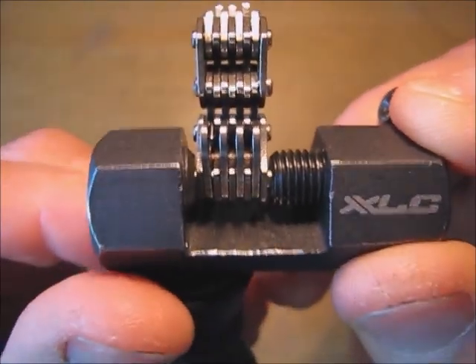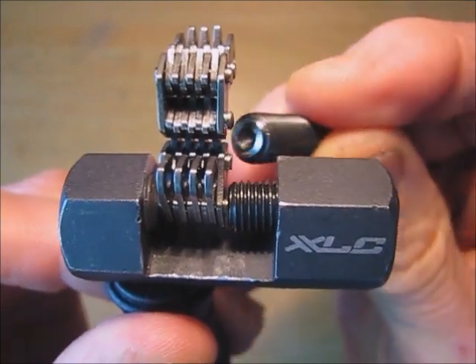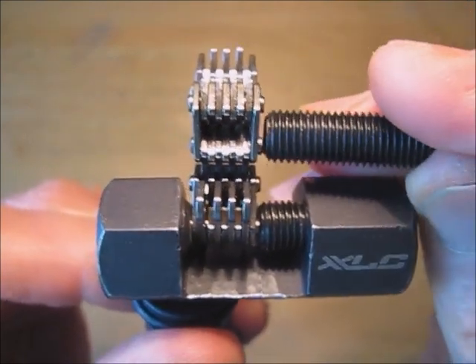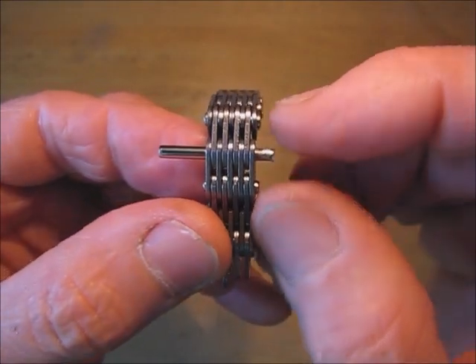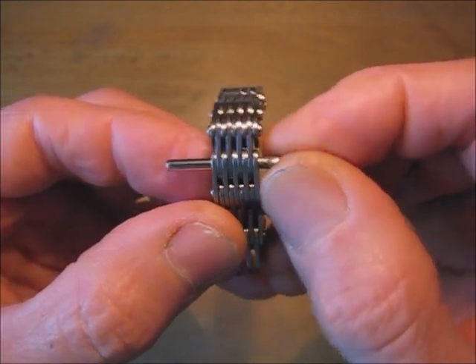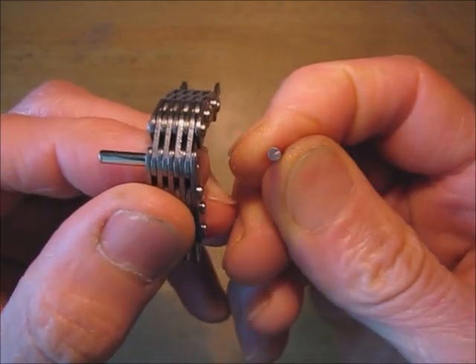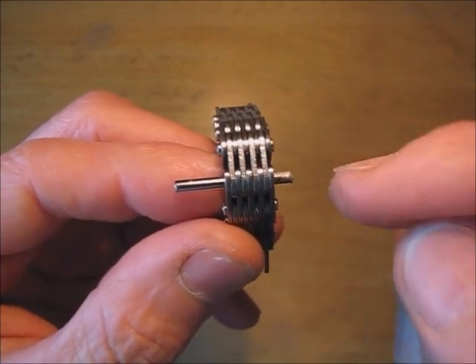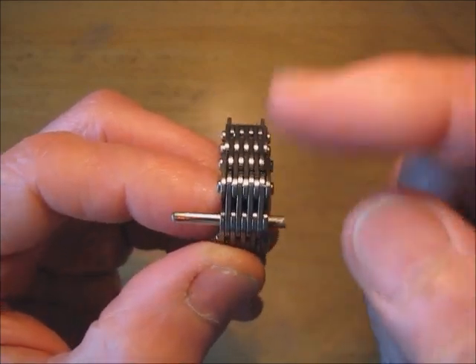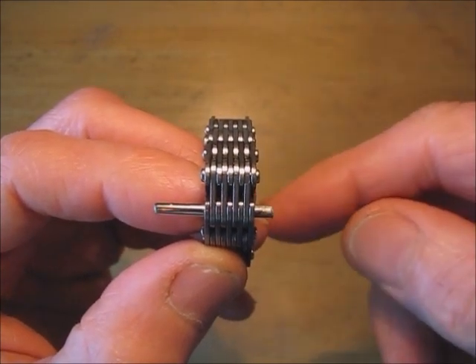For staking or swaging the link pin, I had to grind on the cups of the set screws so that they wouldn't apply pressure on the side plates. I needed a pin to align the holes of the links when pushing the link pin back into the chain. I used a 3/32nd welding rod — it's about 94 thousandths in diameter. I will also use this pin to attach the two chains together and then thread the new chain through the motor.